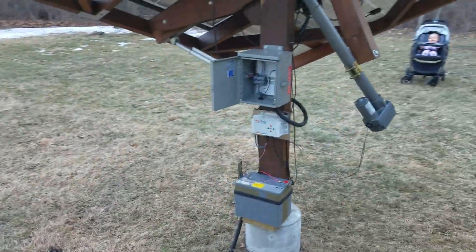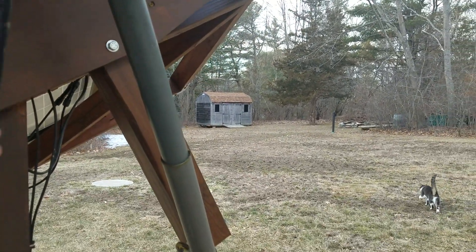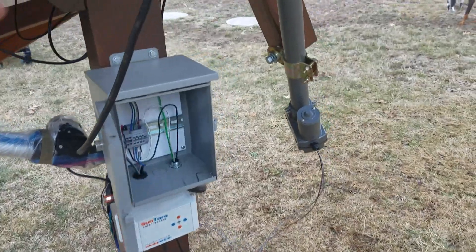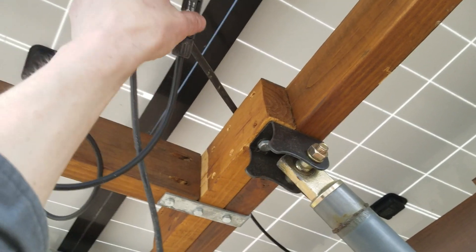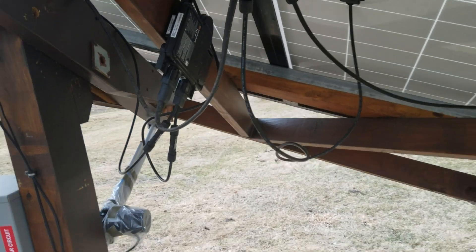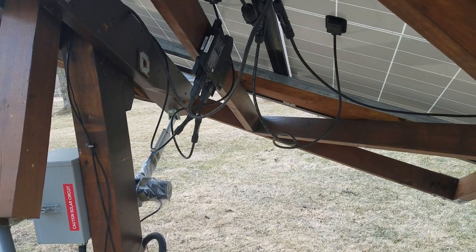The mount setup I have for the east-west actuator is just like a Chevy Silverado shock mount. I have my main trunk cable coming in from the panels — those are just all MC4 connectors to the adapter, which usually comes with it. From there you loop them all together. I went and bought pre-made ones off eBay; they usually take them down from solar fields that have been decommissioned or have gotten upgrades, so I got them pre-made and didn't have to make them myself.